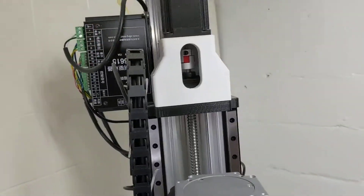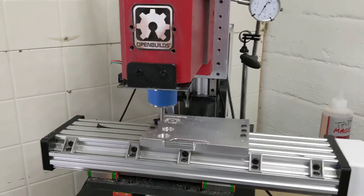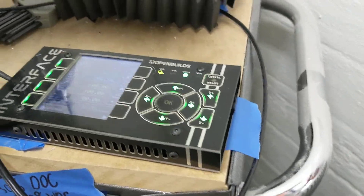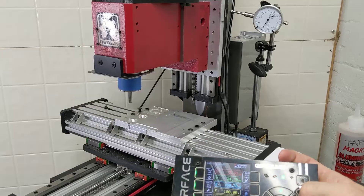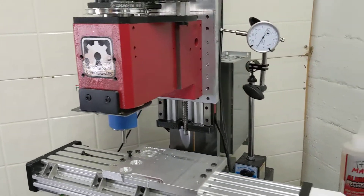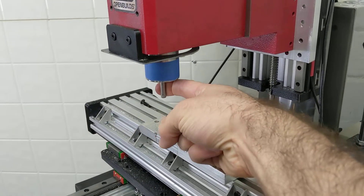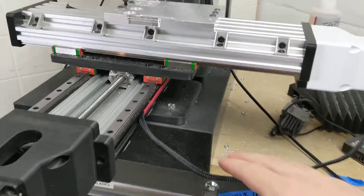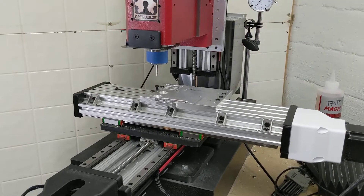I'm using a generic Chinese controller for the brushless DC. Back here is the black box from OpenBuilds — a nice company to work with, pretty responsive. Right now I'm using their interface device with that black box; I can jog the machine around by hand. These are all ball screws, so backlash is very, very little — nothing noticeable. I'm in the process of characterizing how the mill performs: the plan is to apply a known force to an end mill and measure the deflection to get a spring constant for the whole system, then compare the plastic version with the aluminum version.